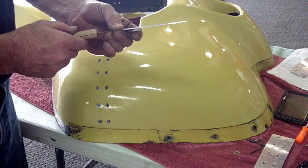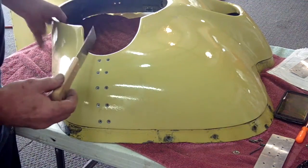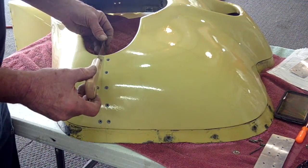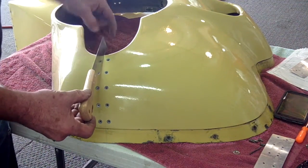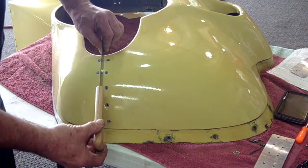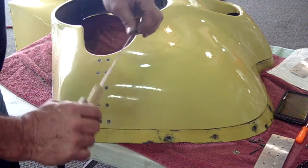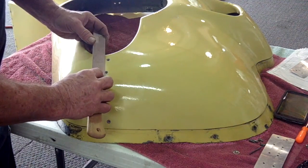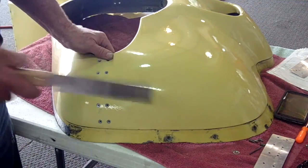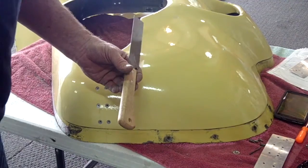It's 1/32nd of an inch thick so you'll make a very small kerf. The trick when making your cut is — as we call it in the forum post — you want a very shallow angle. You want a lot of blade in the cut as you go along. This helps keep it straight so you don't go wandering all over the place, because it is a very flimsy blade. Take your time. This is a flush pull saw, so we're only cutting on the stroke where we're pulling. Be careful, take your time — that's the best advice I can give.